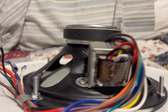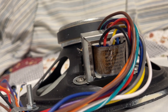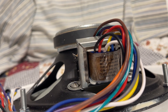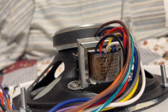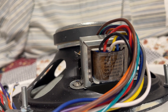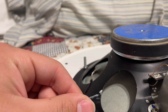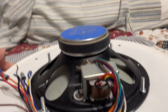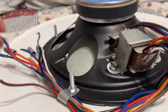This transformer here, which every one of these SD72W speakers will have, has a 25-volt column and a 70-volt column. Black, which is labeled BLK, is on both columns. It's always going to be common. This black wire is always going to be used regardless of whether it's a 25-volt or a 70-volt system, because this speaker is universal across both. So black will always be used.